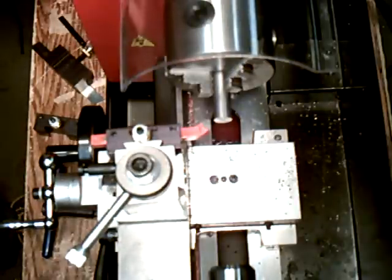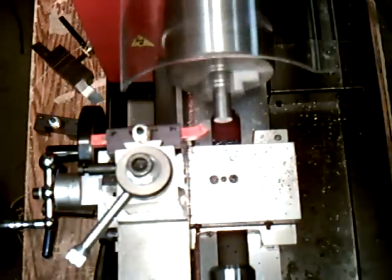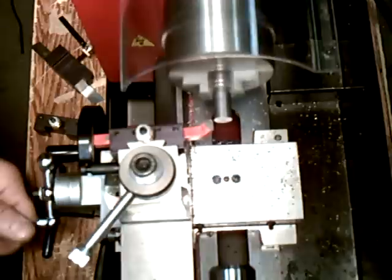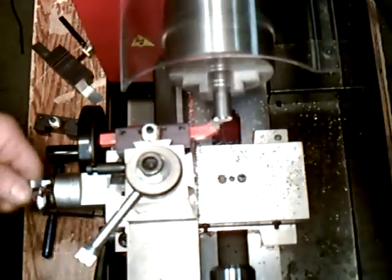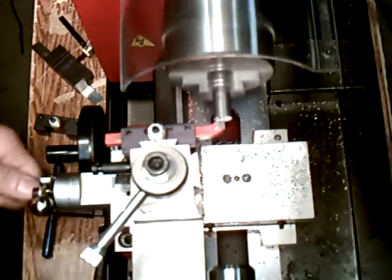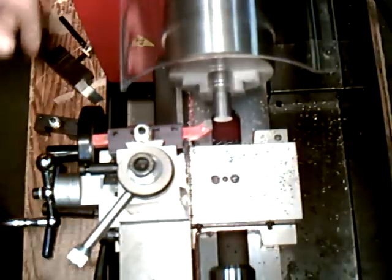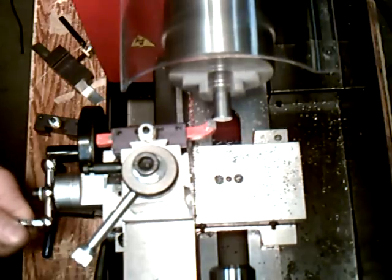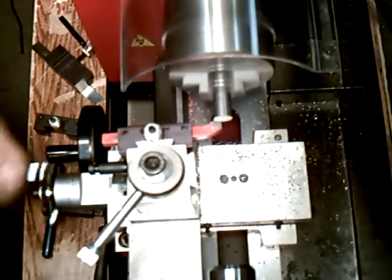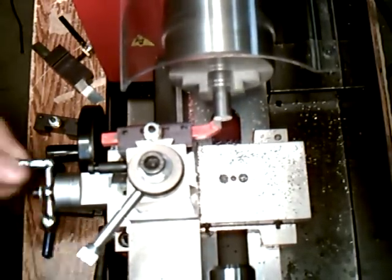I'm going to turn the machine back on, make another face cut, and then talk a little bit about the tooling. Put the power switch on, forward, and turn it about halfway to about 600 RPMs. Take a little bit more off so you can see it. When you're making a face cut, you're only bringing it halfway and then bringing it back. Speed it up, bring it in about a ten-thousandth, and just shave a tiny bit off to polish it up. Bring it back, push it a tiny bit more — and a nice, smooth, shiny finish.